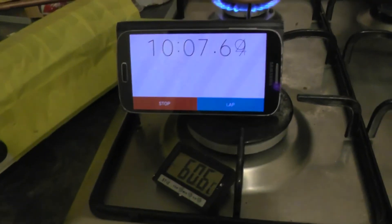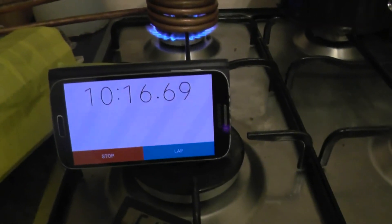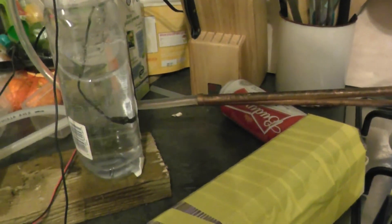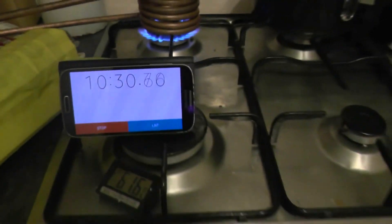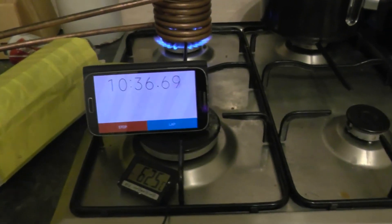At 10 minutes we've hit 60 degrees for one litre plus whatever the tubing and coil hold — 60 degrees and still climbing. I'm quite pleased with this test. The next test I'll have to do will be with a rocket stove or some sort of wood-fired stove. At 10 minutes 30 we're at 61.6 degrees. Thank you very much for watching — please subscribe, comment, and rate, and I'll see you in my next video. Cheers.